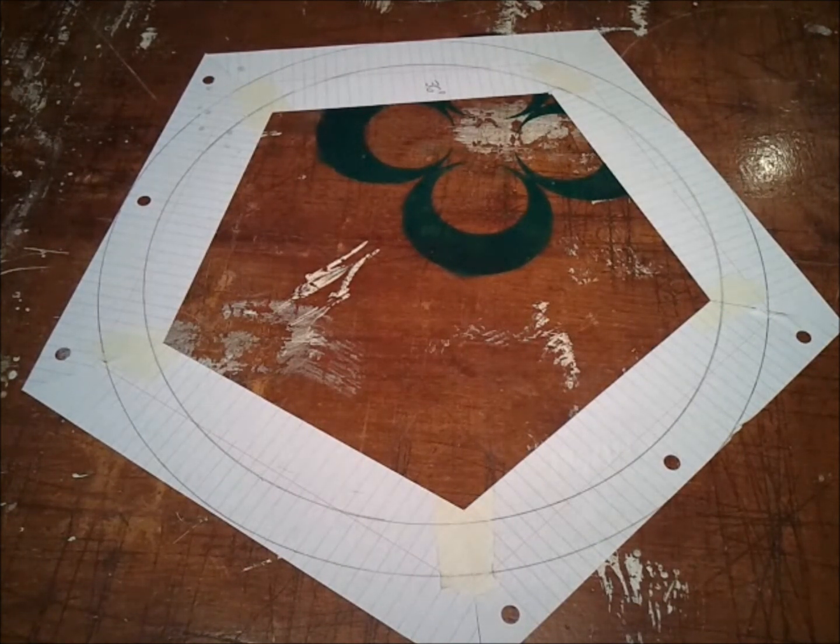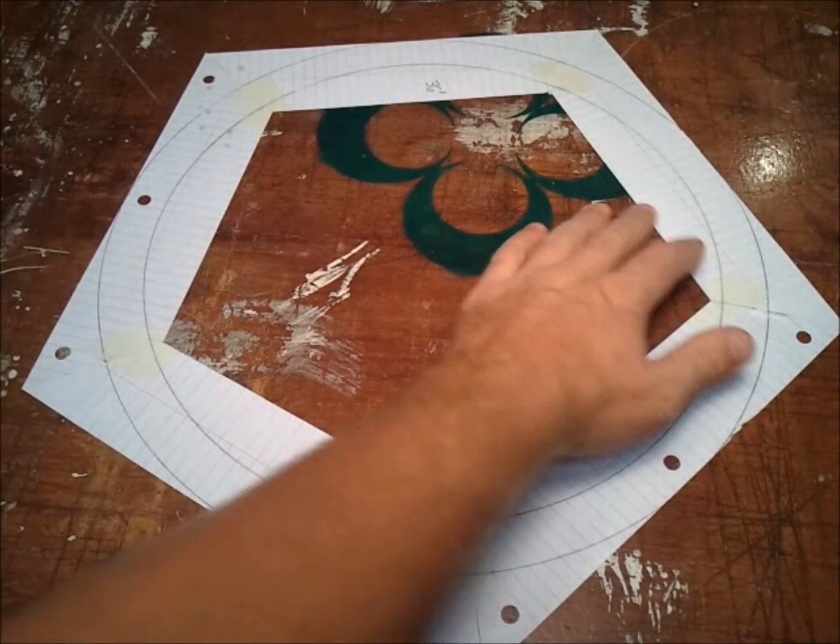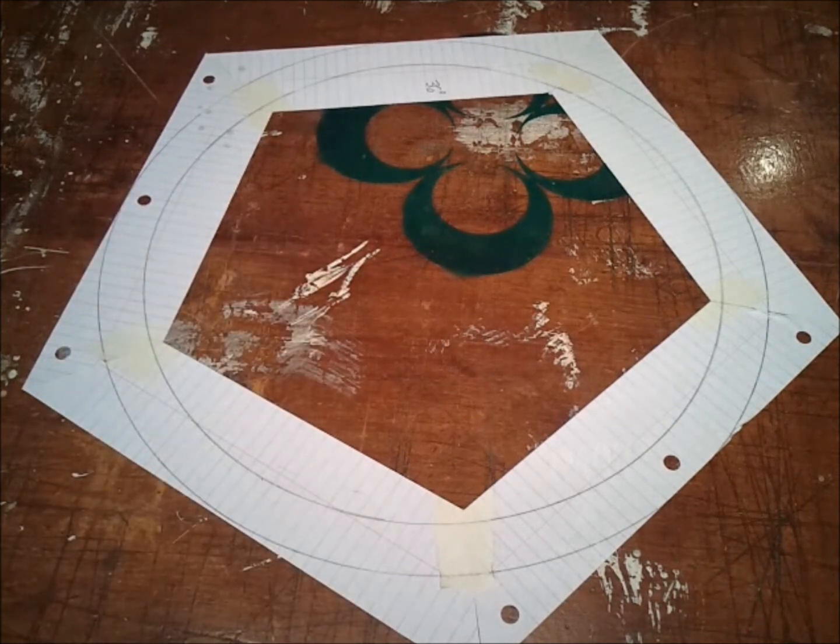Since I chose to make my molding consist of 5 pieces, I'm going to have to cut the miters on each one of my pieces to 36 degrees. If you'd like to review how to make a multi-sided construction and the math behind it, I suggest you look at my wishing well video, and there's a really short and easy tutorial on how to do the math.